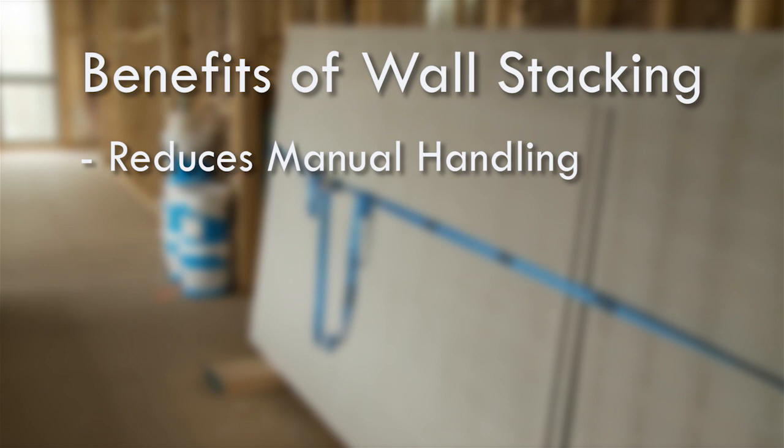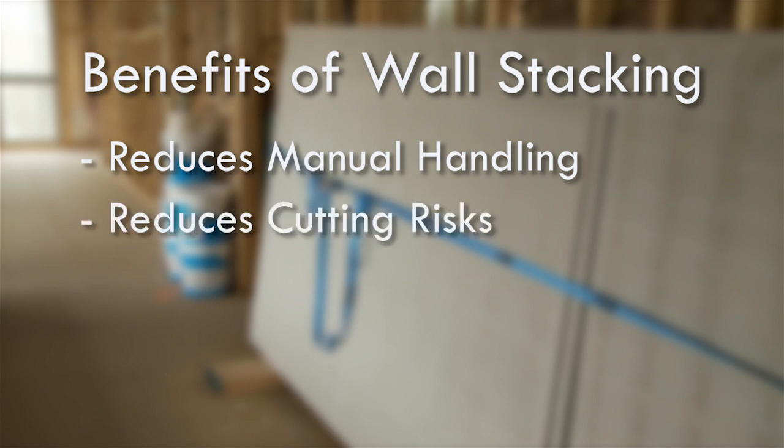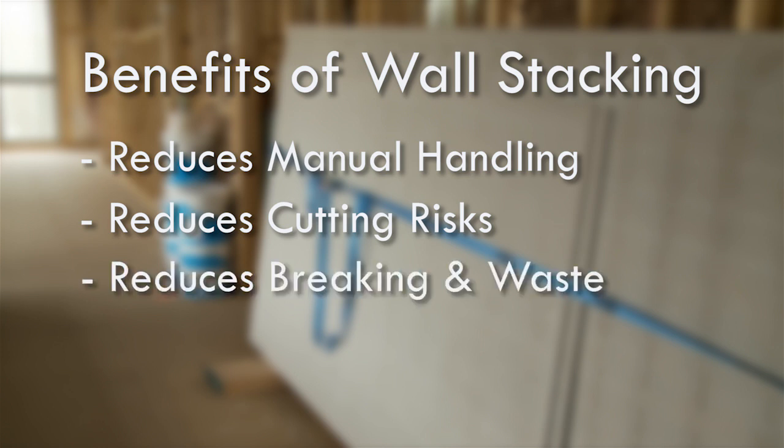Some of the benefits to stacking against the wall are: it reduces manual handling issues for the installer, bending over, lifting, etc. It has reduced risks when cutting the plasterboard, fewer lacerations. Sheets don't break as easily when stood up, so the waste in materials is reduced.